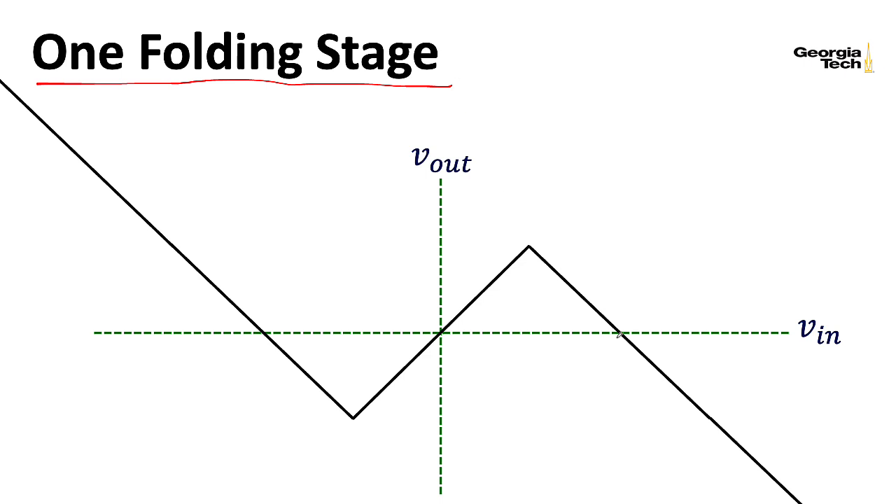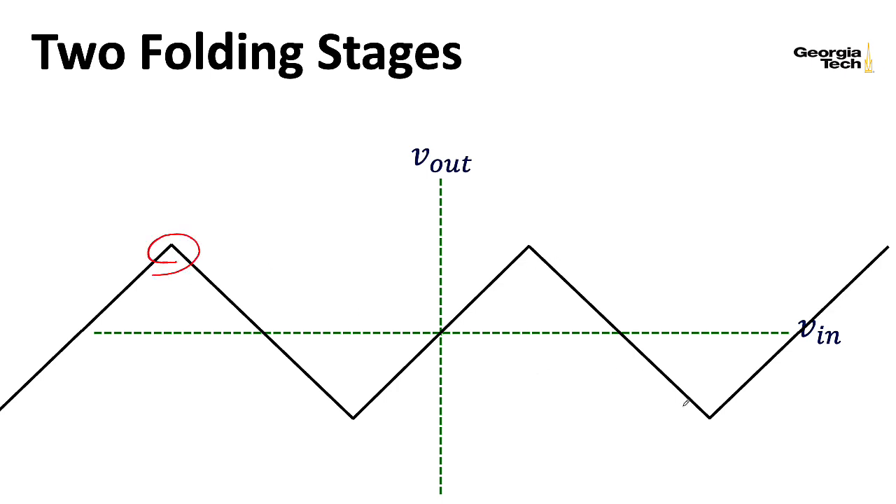One of the stages of the Serge wave multiplier: if you put in a signal that stayed within a certain range, you would get the same signal out because you're staying in the linear range. But when you hit the edge, he designs the circuit to fold in on itself. If you wanted to make a zigzaggy pattern that went up like this, all you would do is pass this through an identical stage. So if the output of one stage starts to go negative past a threshold, that would be equivalent to a certain input in the next stage, and it would fold over. Taking one of these stages and cascading another adds another couple of teeth to this waveform.